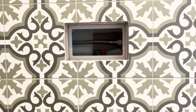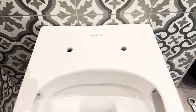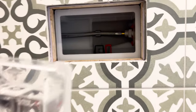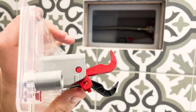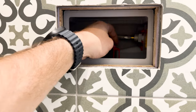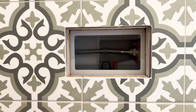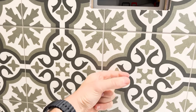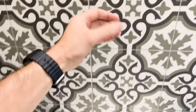Fill that up for a little test. This is the first time I've used this Techie frame and I'm actually really impressed with it for the price. I've got the frame and this Drew rimless toilet with a soft-close seat for £400 all in — I think that's bloody brilliant. This hooks in under these two tabs — when you press the button it lifts them up and flushes. It's like a tank of water and this little thing has a washer — it's like the plug at the bottom of the cistern. You lift it up, it pulls the plug out, holds it up, all the water flushes down, and then at the end it puts the plug back in. It's as simple as that.